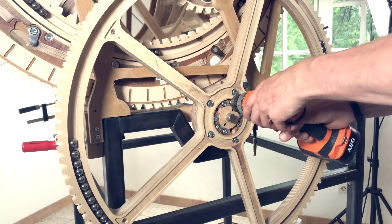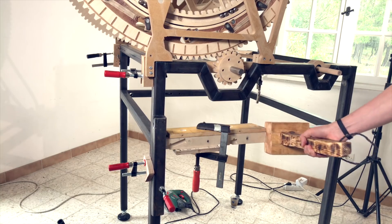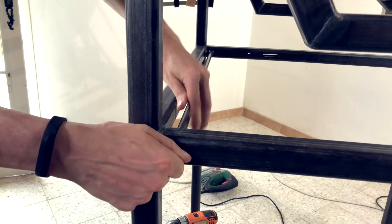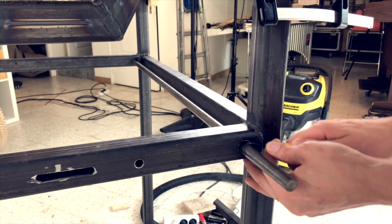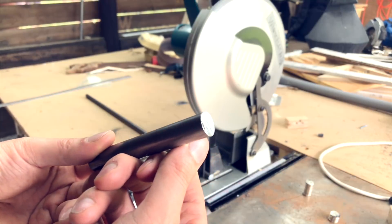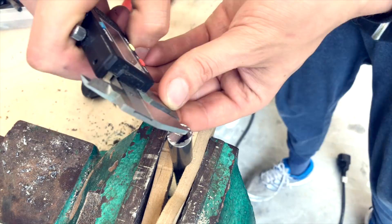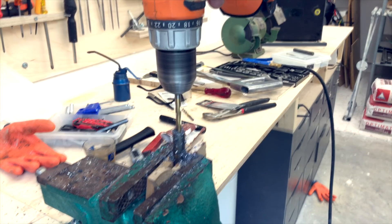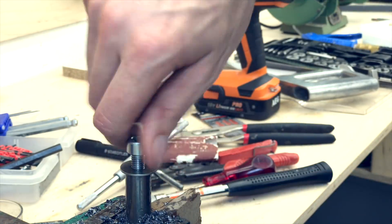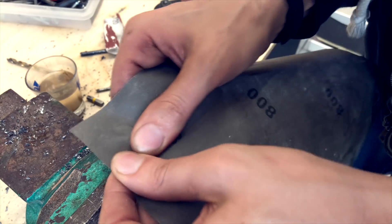To be able to drill those holes, I had to remove the big marble lifting ring gear. Here you can see that I'm attaching the template on the other side as well, so that hole location is very precise. I'm measuring here how long I need the pivot shaft to be, making a little mark and cutting it off to length. I don't have a metal lathe, so I challenged myself with tapping the M8 thread by hand to see how precise I can do it with hand tools. It's not completely concentric or vertical, but this shaft has no rotation - it's just supposed to be stuck and still. And I think in the end I got it really nice. It really works.